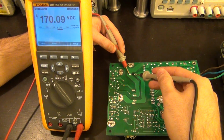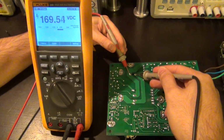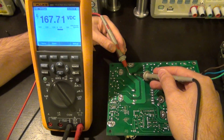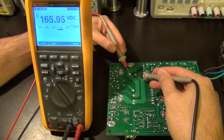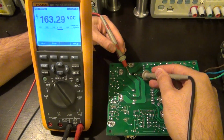I'm going to turn off the light with my foot and you can see the discharge. Look, it doesn't discharge. It stays there and drains very, very slowly because its only discharge path used to be the standby DC-DC power supply, which is right now disconnected and not working because of the mechanical fault that it has, or the cold solder joint or whatever.